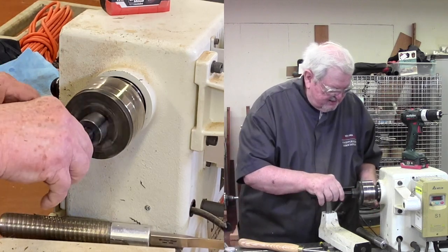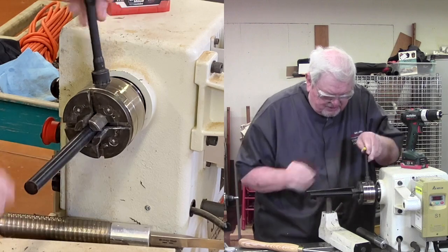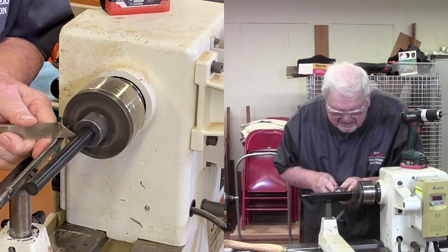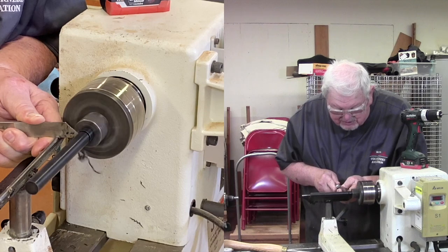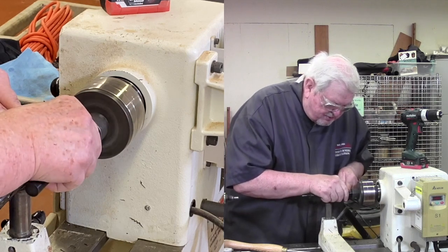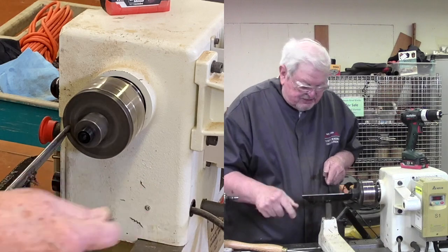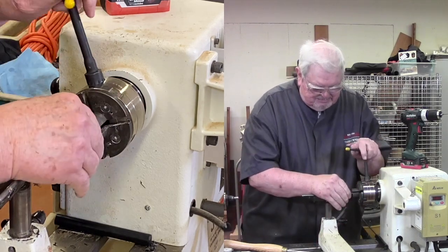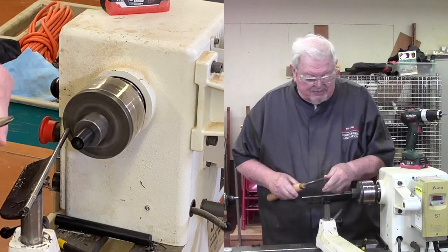So now I know where three inches is. I'll reverse it — here's my mark. Parting tool. It cuts like butter but it loves to wrap around things. I just want to be able to see where my tool goes. I'm going to bring this out just a little farther so I have a little more space to work, and it will not vibrate as much because it's not quite as far out as last time. Look how much more true it's running.